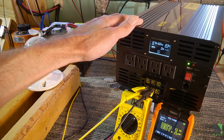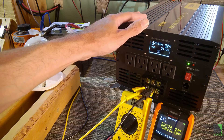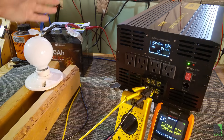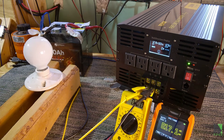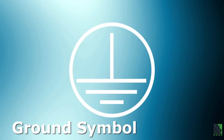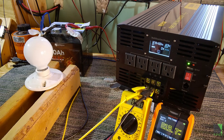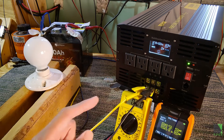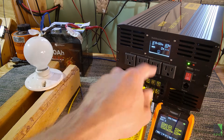This inverter is not feeding voltage between neutral and ground. Why did I say earlier that that isn't ground? This inverter is floating — it has no connection to ground or protective earth. It's just sitting on a workbench with a battery, two wires powering the inverter, and that's it. There is no ground. That middle terminal with the ground symbol above it is not ground and it's not protective earth. That middle terminal is there so that you, the installer, can supply a protective earth or ground to the inverter — not coming from the inverter. So live and neutral are outputs, but ground is actually an input.